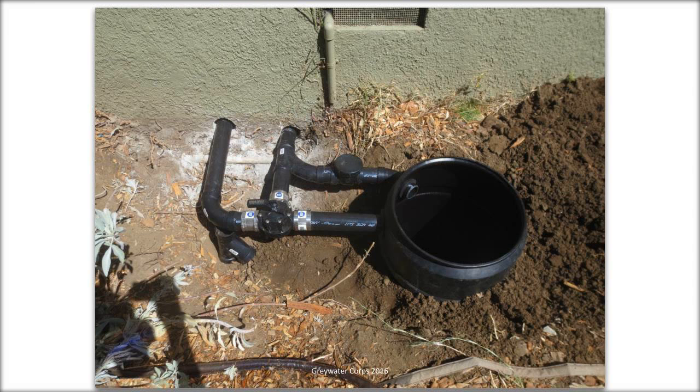In this version, we are up away from the sewer lateral, and there's a bathroom right above this, in the house right next door. We are coming out with our gray water, and there's the three-port diverter valve, and then to get back to the sewer, we are going back into the house. So we are not close to the sewer lateral, to the sewer main, in this particular drawing. We are coming out of the house and back in. And this can be done if you've got a bathroom or something that's kind of remote from everything else.